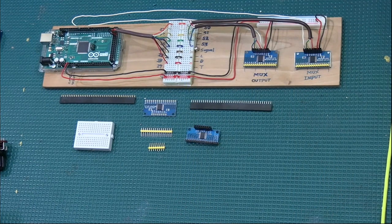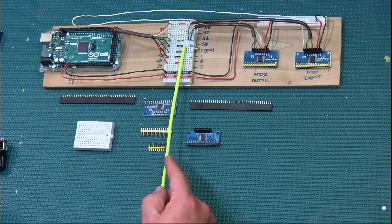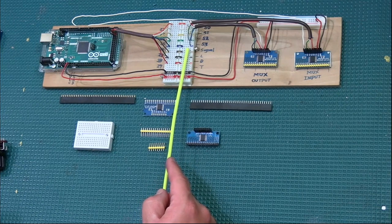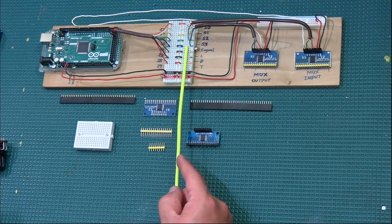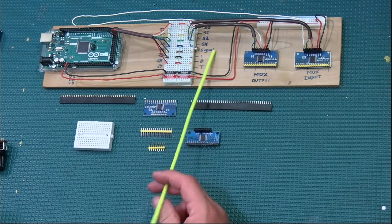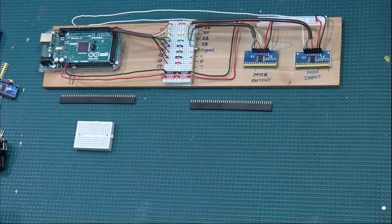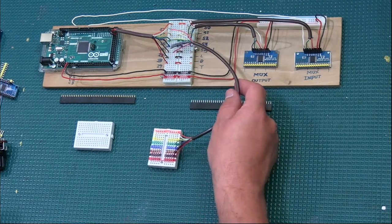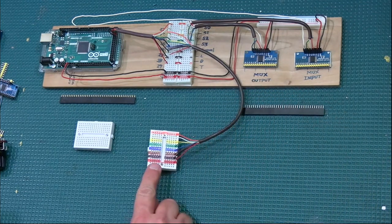Okay, now let's say I wanted to add more multiplexers. So of course, you're going to put your main system bus distribution as close as you can to where you're going to have most of your buttons and switches and everything, right? So let's say you put this right by the front of the cockpit, and then you wanted to also have all the switches and everything that you're going to have on the overhead. Okay, so what I would do is I would take another extension with the 8 wires going to another little hub that's going to be on my overhead panel. And that one right there, then I would tap into that one.